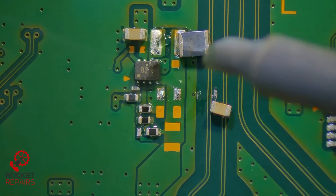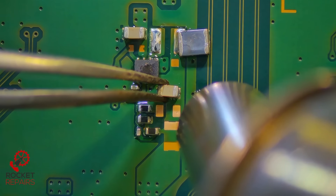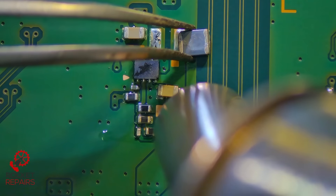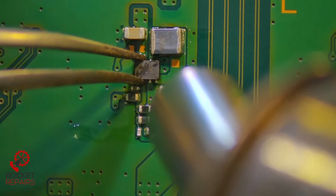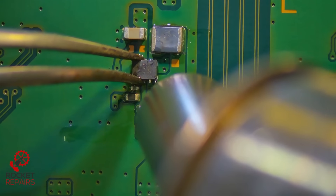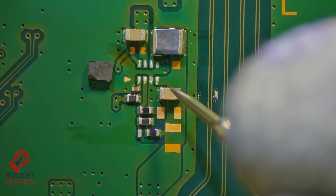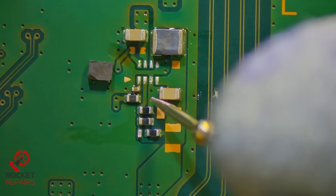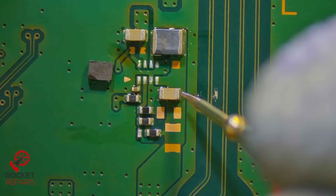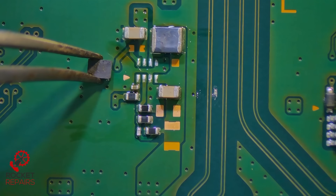Just a bit of leaded solder. After all that, that little component was getting hot. Do we still have our short? Yes, we do. Looking at it now I can see that this is ground here. So this side is actually meant to be as it is, which is fine. However, this side is not meant to be ground. So I am going to put this component back. I guess at this stage you could argue I should have just injected voltage on that path, but I didn't know that other side was ground to be fair.